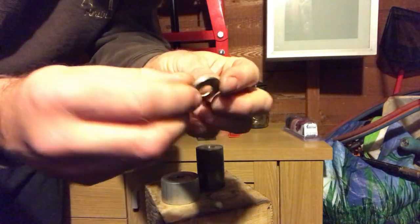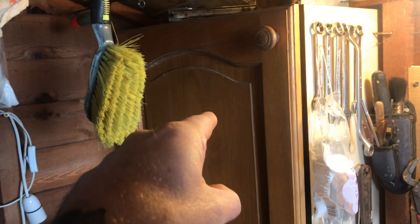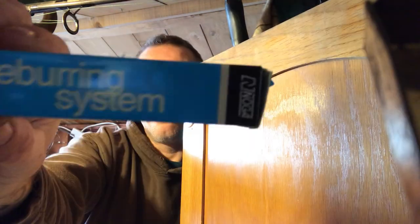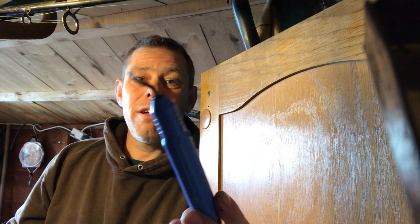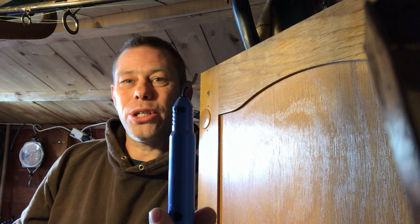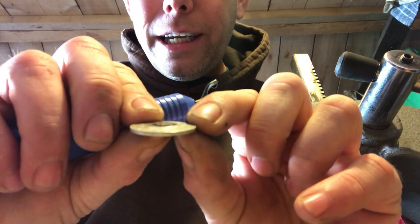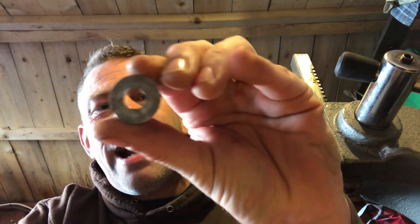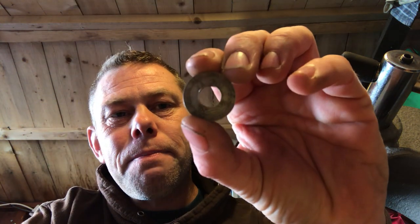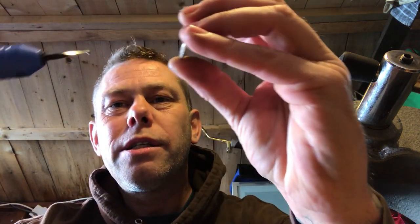That's the first process done — we've got the hole punched through the coin. The edges are a bit rough so we've got to deburr that. I've got a deburring tool for that — it's only about 4 or 5 quid but it's absolutely awesome. It's as sharp as a razor blade. The inside is really rough and it's got to be dead smooth with no signs of cracks. Any little tiny crack, as soon as you try and stretch it, that's where it splits.